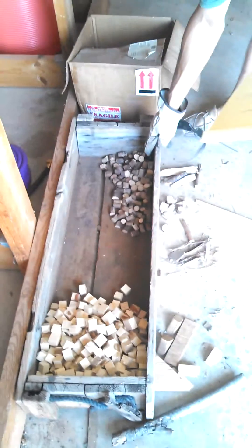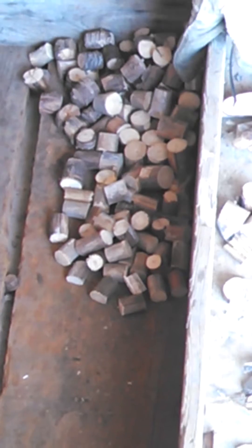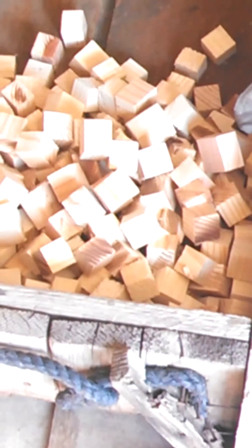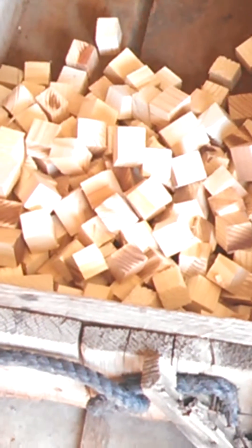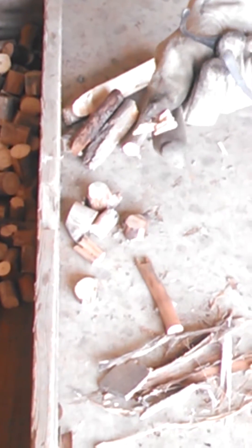On the material preparation, you can see the materials I've produced right here. What we've got is some half and three-quarter inch pelletized wood — just sticks cut into little tiny dowels. You've got these three-quarter inch white pine cubes. That's your preferred material. You don't want to use any kind of long sticks, any pieces with chunks and bits falling off of them. Don't use any bark, don't use any odd-size construction materials, and obviously don't put long sticks in it — these will get caught up in your hopper.